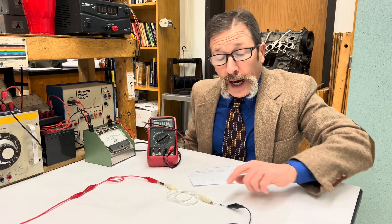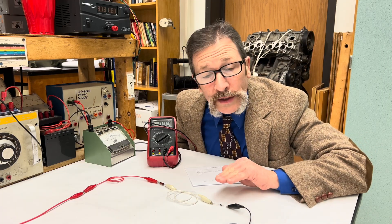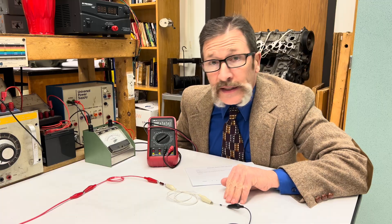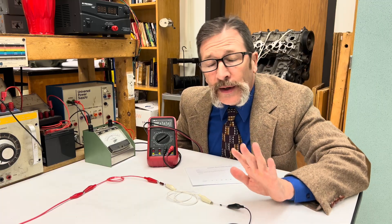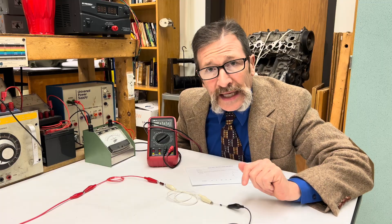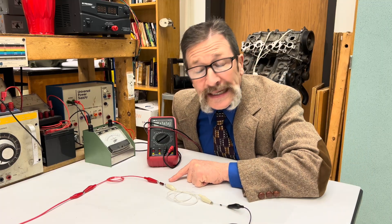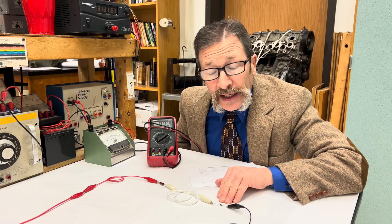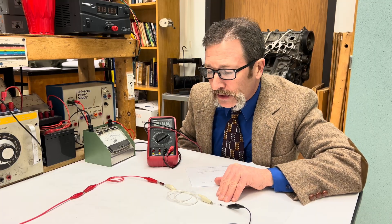Let's actually explain this quiz. Unlike resistors, diodes are not just a classical idea — they're more of a quantum idea. The silicon diode always drops somewhere in the range of 0.6 to 0.7 volts. So no matter what this resistance is, it doesn't matter, because the diode is going to always drop that 0.6 to 0.7 volts. We'll say 0.6 for this particular diode.